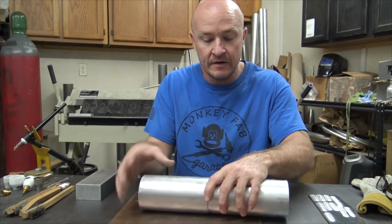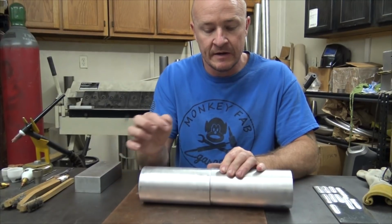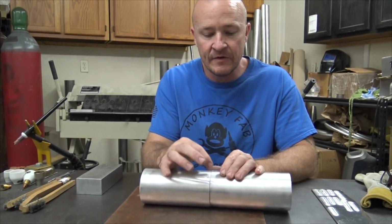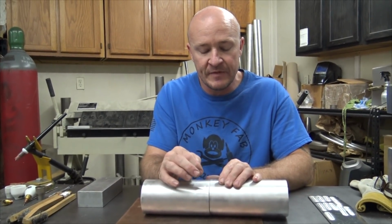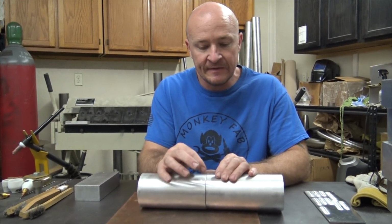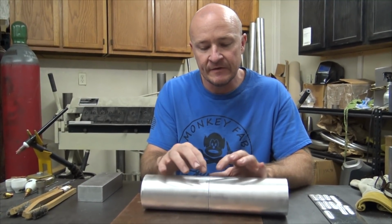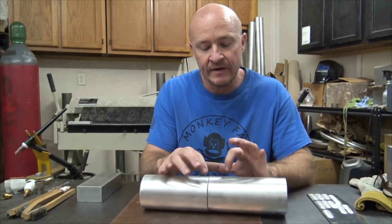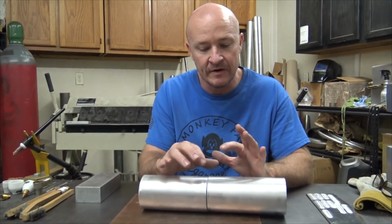You can fill a gap on aluminum. However, when you see the welds on aluminum that look like a stack of dimes, the perfect width, perfectly spaced, that's all about repeating the exact same dab over and over and over again. So if you get to a place with a gap, you're going to need to figure that out. Maybe it takes more filler rod in that one place, maybe you have to hang out longer, or whatever.